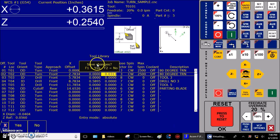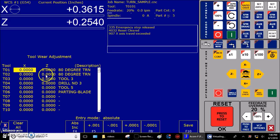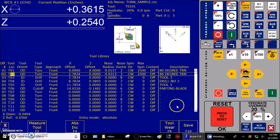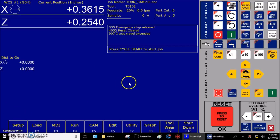On the tool wear screen, I'm going to verify that tool two's Z offset value is set to zero. Press F10 Save, then F10 Save one more time just for good measure. Click Escape, back to the home screen. Now, step three: we're going to touch off the tool at Z zero. Let's move on to that step. Let's get tool number two all ready to go, get it touched off in Z.